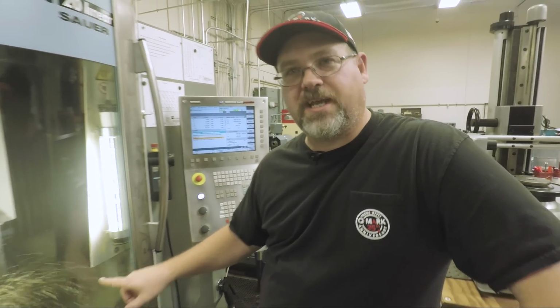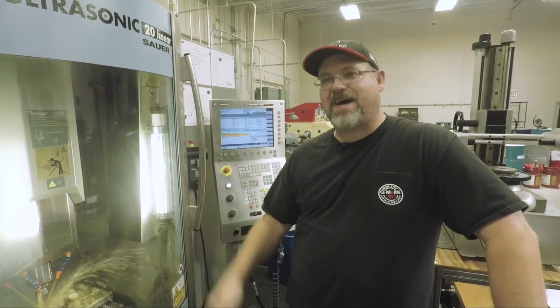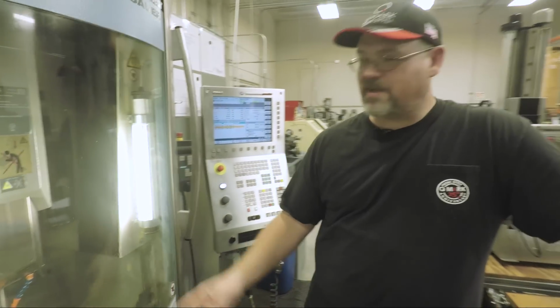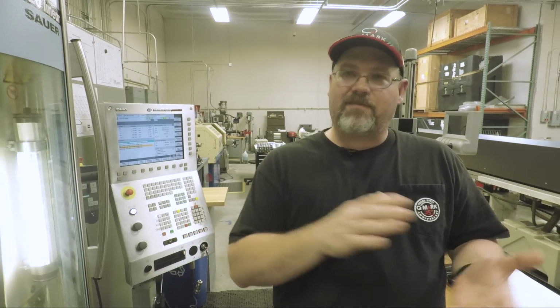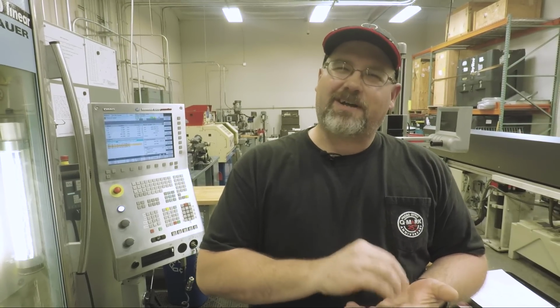And we actually had to special order this machine as a three axis because we needed table space. You lose the five? Normally it came as a five. Yeah, that's funny. And we bought this machine because we used to buy all of our balls and all of our stems from outside sources. All the balls came from overseas, and supply got to be an issue. The other reason we got into grinding is because when we get the balls with holes already in them from suppliers, their tolerances aren't always that great. If we tried to complain, coming from Switzerland, they'd say, that's what we have. You can wait 6 to 8 weeks for a new batch or accept those. That's why we brought the grinding of the stems in, because we used to grind them per batch, to make sure they fit.